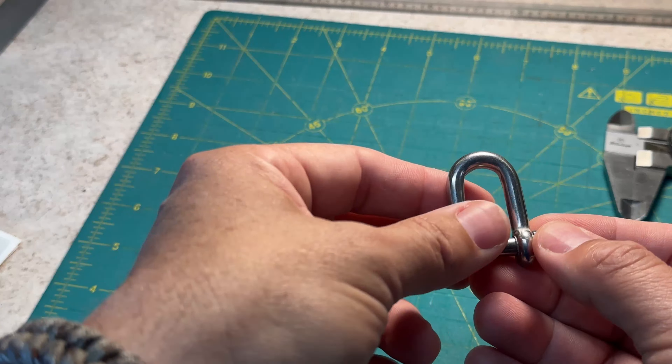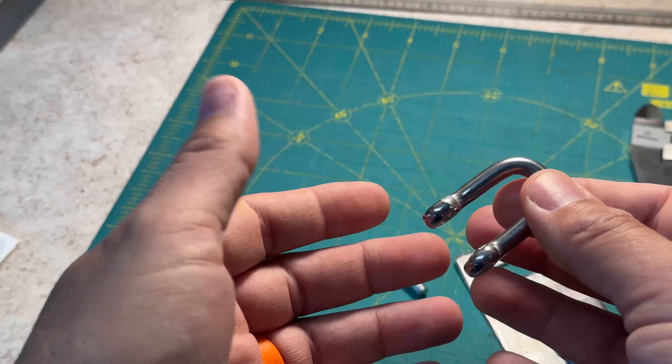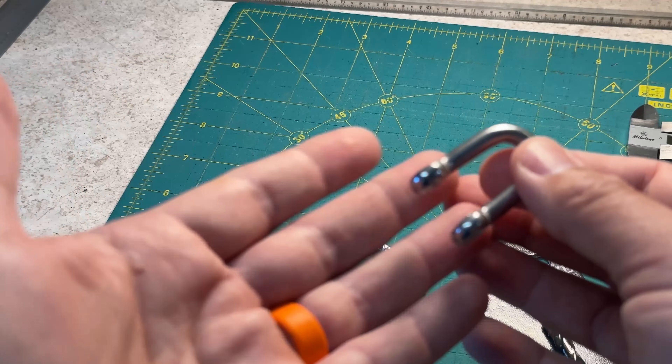It'll give the mounting spot more flexion than it currently has, because right now these hooks are pretty much all the way down to the ground and there's not a whole lot of play in them. So when storms come through and move the antenna back and forth, this thing is wiggling pretty hard. With the T-posts, you're getting eight-foot T-posts and at least four feet of them going into the dirt. It's anchored plenty deep, and those T-posts do flex — they're made out of steel. That'll give it a little more room, and it'll also let me mow around the T-posts without breaking another one.